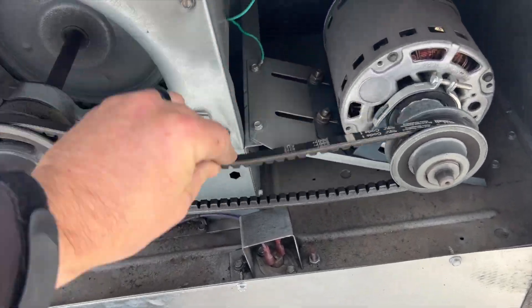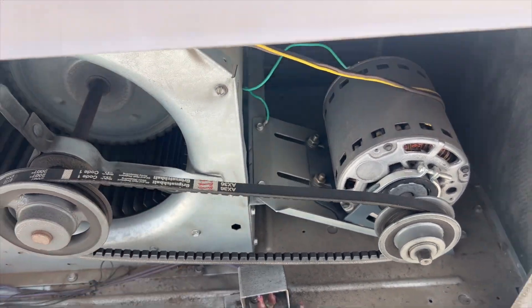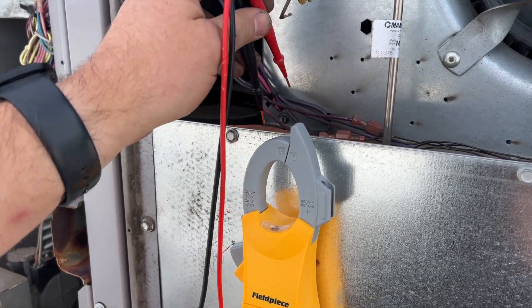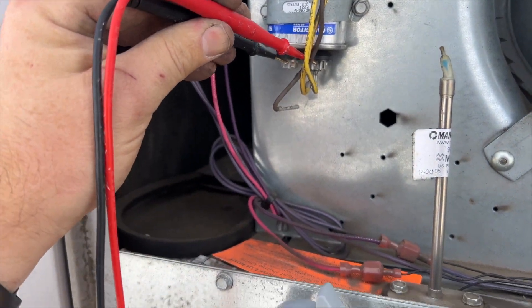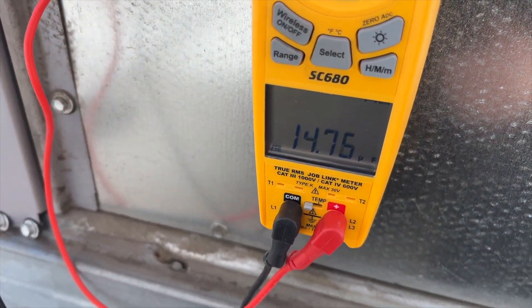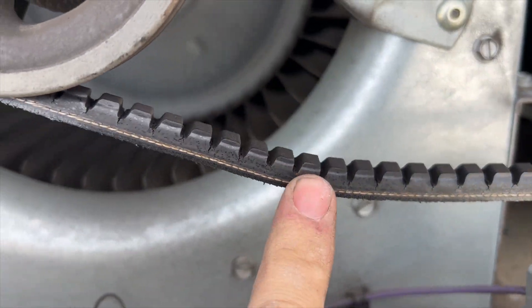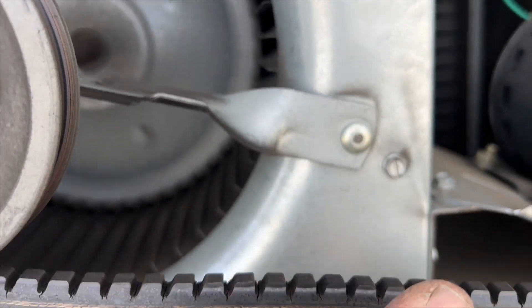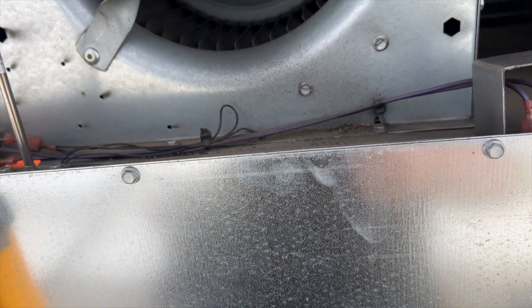This one's all super crazy loose too. That's an AX36. We're going to check the run capacitor — it's a 15 — and it's good. This belt is cracked too, so we're going to change this belt and then readjust it so it fits.